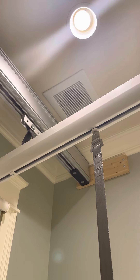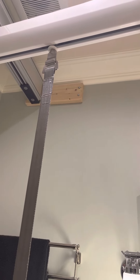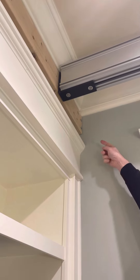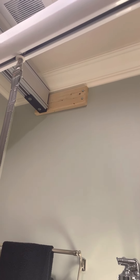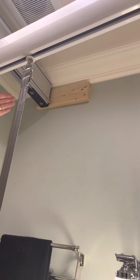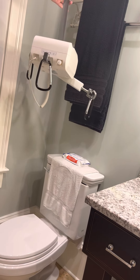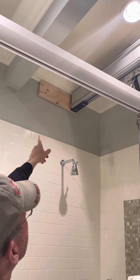The length of the 2x6 depends on where the studs are. Because this cabinet is in here, there are no vertical braces between here and here, so I had to go out to the corner to catch that. There were studs on 16-inch centers, so we bolted into that, and the L-bracket we could adjust where we wanted to — close enough to get this assembly over the toilet. The same thing at the other end over the tub: we mounted the L-bracket close enough to get over the centerline of the tub.